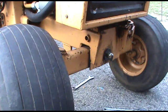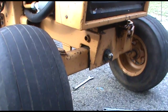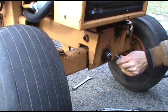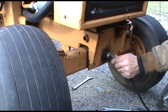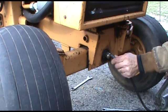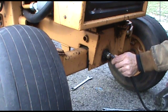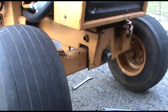So if you have a lot of play in your front axle on your loader tractors, this here will help fix most of it, if not all of it, depending on how much wear is on your tractor prior to installing one of these pins. Now we're going to go ahead and grease it up. It only took about 3 pumps on the grease gun. And that's it. Thank you for watching and good luck.